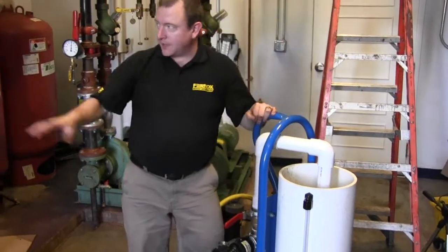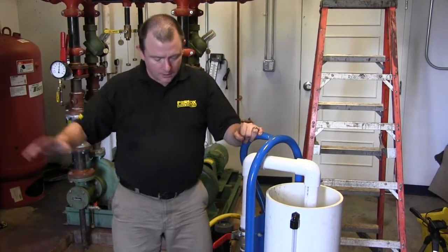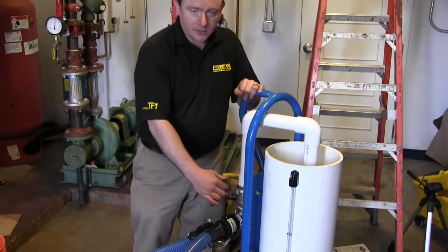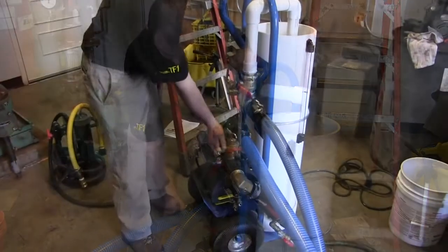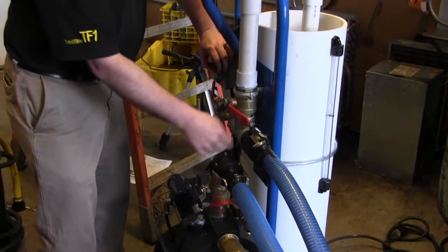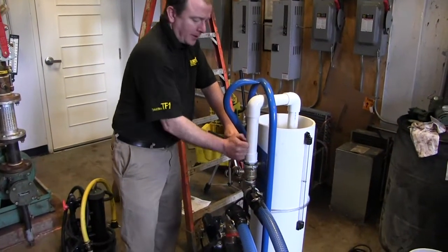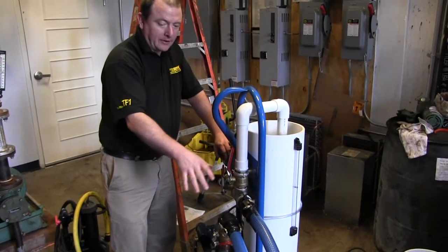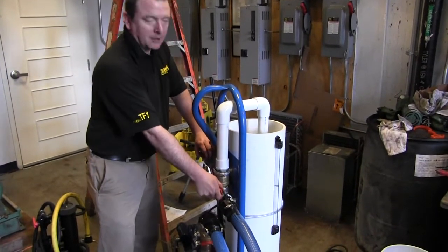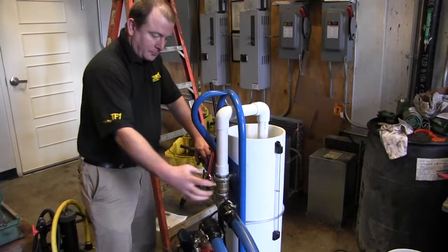Once the water's full and you have all your connections, you can open all the valves on the system side at all the connection points, but make sure the valves are closed on the machine because you don't want all that pressure coming back. Your first step is to open up your valve for your supply and turn the motor on — this will start pumping water from the tank into the system. At that point, open up your return valve. You'll have a little bit of air left inside the hoses, so to get that out, deadhead the pump: just shut it off a little bit, let pressure build up behind it, then open it up and it'll start pulling through.